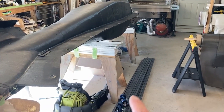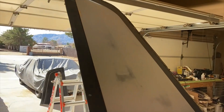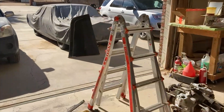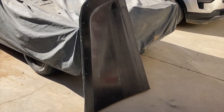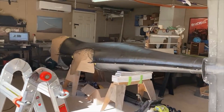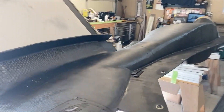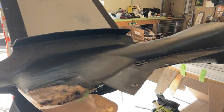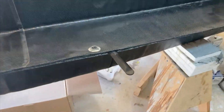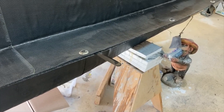I really shouldn't be doing this but I just can't wait. I know I need to get the stands built and get the molds up on the stands before I do this, but I guess a little bit won't hurt. I popped the right lower stab and elevator mold off and the plug came off nice and clean — that's good. The mold itself looks pretty good as well. I see a few little things that need attention but a simple sand and polish will take care of that. I thought I would share with you the best sound in the world — that cracking sound when you're releasing a mold.